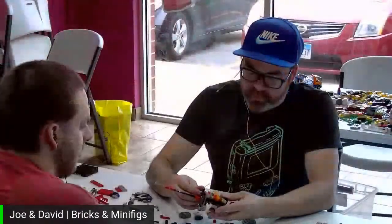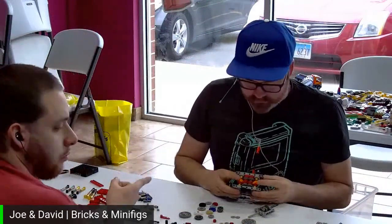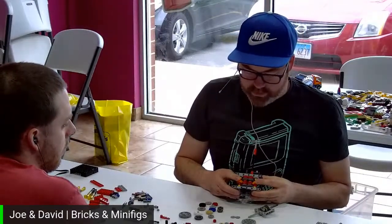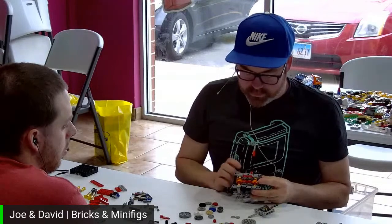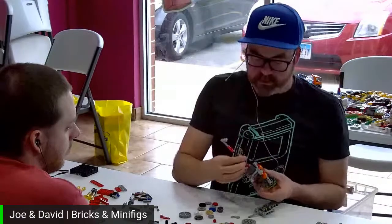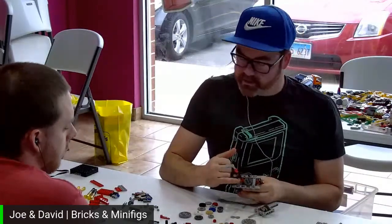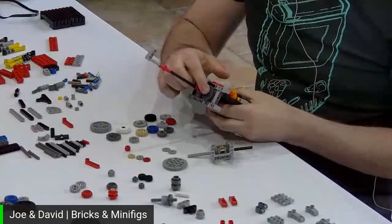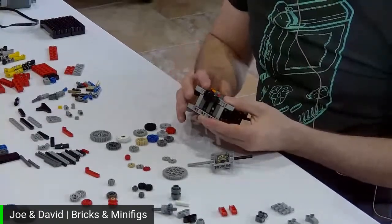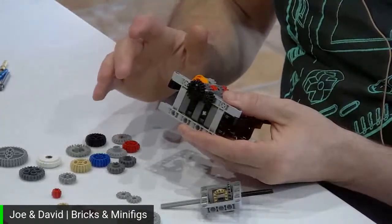And by here, I'm going to go this way. So these have ups and downs every 90 degrees. So by offsetting these, you can make sure that only one gear is engaged. It's switching. But the transmission works very simply. This is our input gear. It's coming in and spinning the smallest gear possible, and it's meshed up with a 3-to-1. And on the backside, you've got a 16-to-20. Right. So in this transmission, you have 4 speeds going from 5-to-1 all the way to 1-to-1.